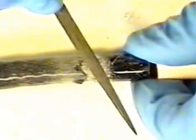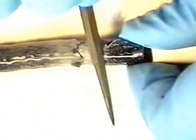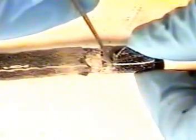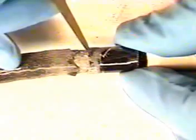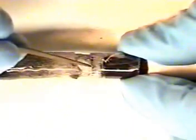Again, if you don't have access to a Dremel tool or are uncomfortable using it, use a plain file to file off the glue. File the glue all the way up until you meet the Scotch tape mark. Again, be careful not to file down into the insertion tube. If you do, you will cut into the bindings, which will cause threads to pop up, which will make it difficult when it's time to re-glue the bending rubber sheath.